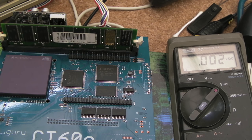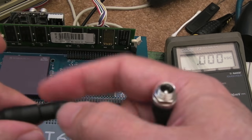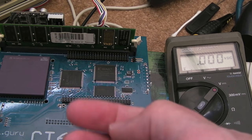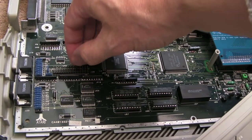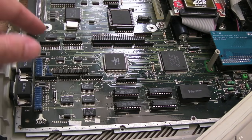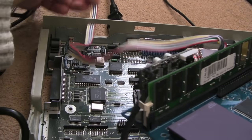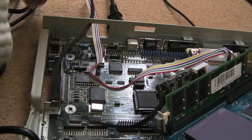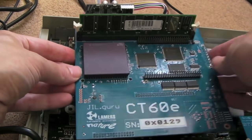Voltages are okay, the power supply is okay. I'll switch it off, disconnect it, and stick some tape around there to make sure it doesn't come off and get mixed around. The next step — moving the keyboard out of the way — we need to remove the jumper I added earlier to enable the onboard processor, and carefully feed the LEDs, switches, and power connector out. This is how it shipped to me.